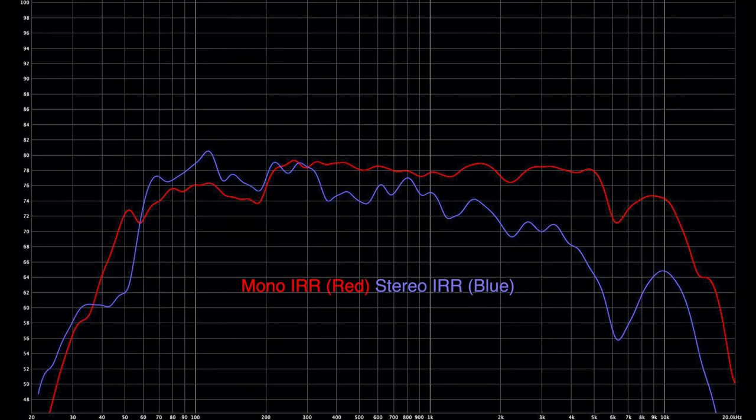How they sound is very subjective. I took my in-room response measurement to see what the computer responded. Based on my in-room response measurement, I measured from about two feet away from the speaker as a mono measurement. As you can see in this graph, the red line is for the mono one-speaker measurement, and the blue line is the two-speaker measurement from ten feet away. That is the response I get in this room — these measurements just show how they responded acoustically.